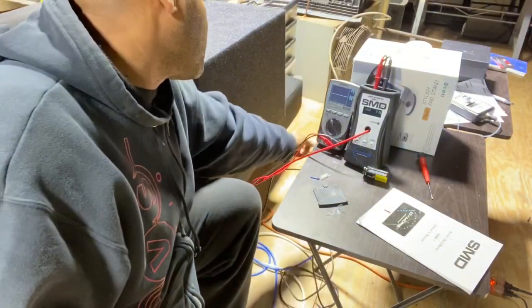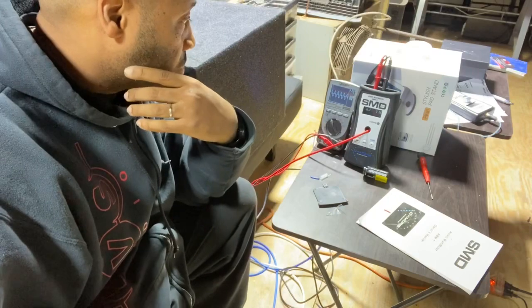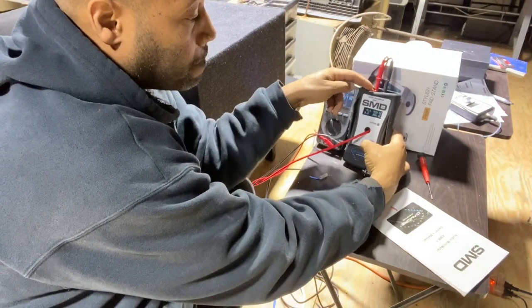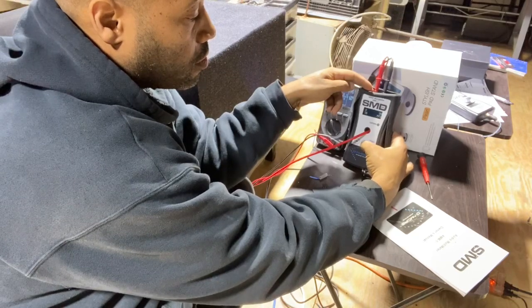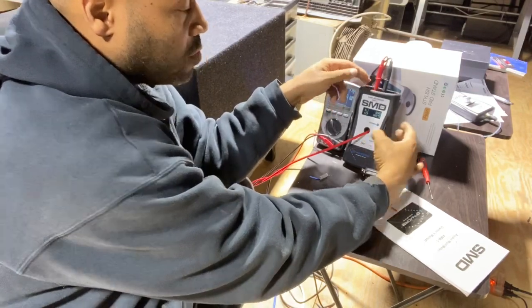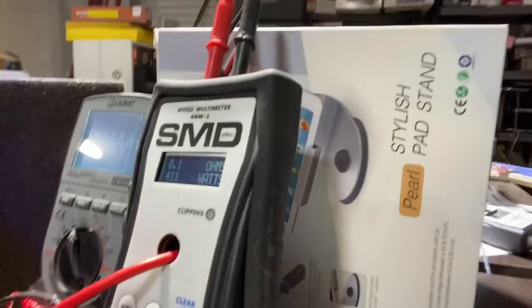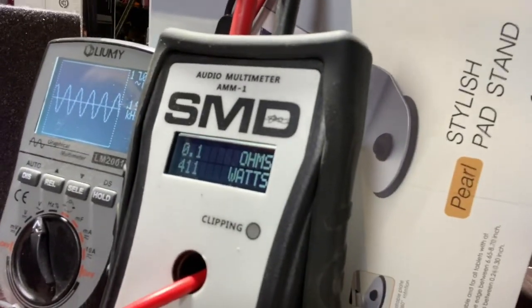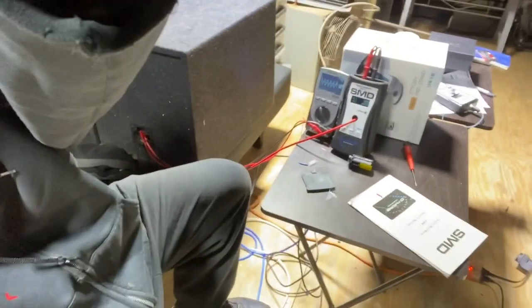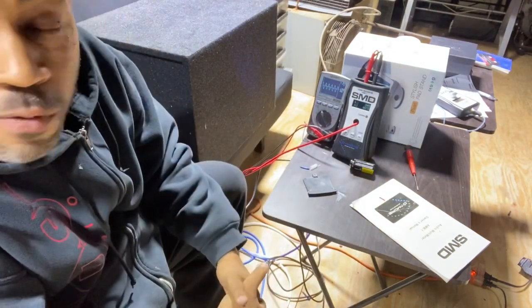I had to put a new battery in the meter and restart the test — 17 volts. Now you're going to set the meter mode. We're reading 429 watts. Dyno power: 411 watts RMS.